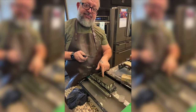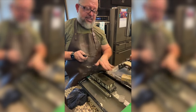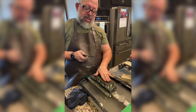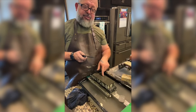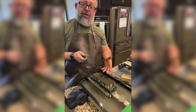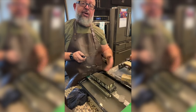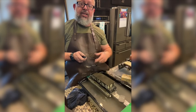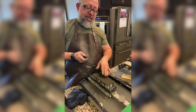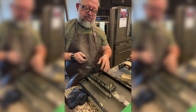Doing it on a stone is difficult. So it's like sandpaper that is hard. And synthetic stones have a fixed pattern. Natural stones come from the earth. So you have to search long and hard to find a natural stone that the pattern is even with no big rock in it that gives you an odd scratch. So anyway, we're on some natural stones right now.